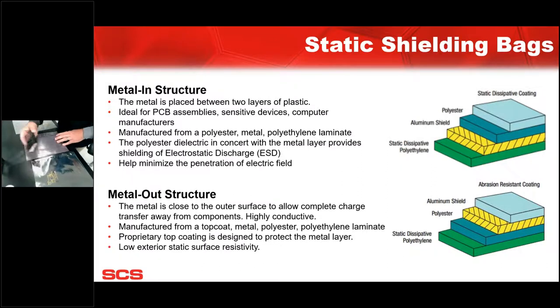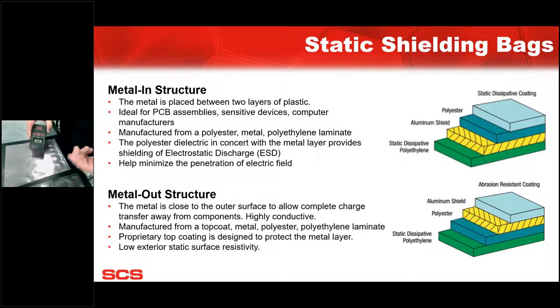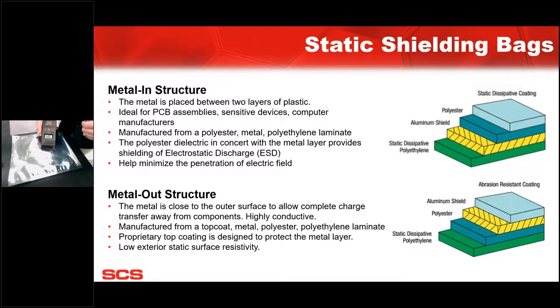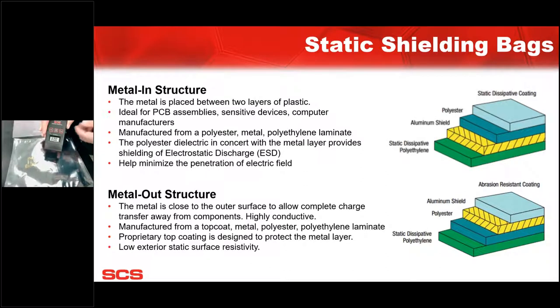We can do that same charge method on a low charging pink poly, and we don't get a lot of activity. It stays around 0.03, 0.04. So, it doesn't charge, right? Static shielding would be the same way. We want to test that outer layer, make sure that we're not charging up in any way to induce that into the atmosphere, and we're good again.